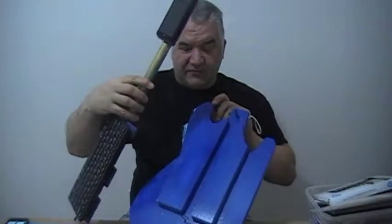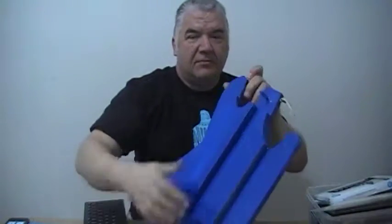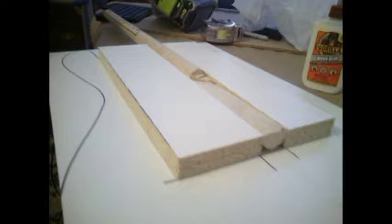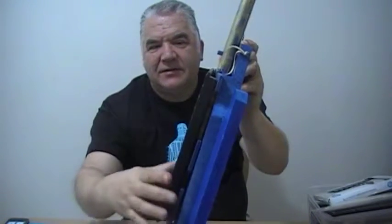So I have a piece of doweling, which is 1-inch dowel, and with two pieces of scrap either side, the dowel fits between them nicely. They hold it in place and stop it from going up and down. Because I've got a hole through the piece of doweling in the middle, and I put this peg here, I can put the doweling so that one end's up here and the other end down the bottom, and I'll switch it around. I cut a flat in the piece of doweling and glued on this piece of wood at both sides to attach the keyboard and phone to. The height is adjusted so that the piece of wood lies flat on these pieces here.